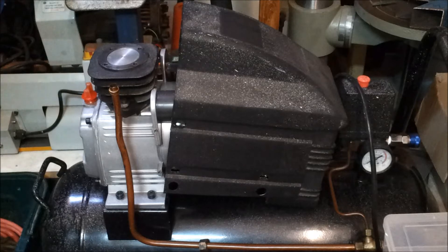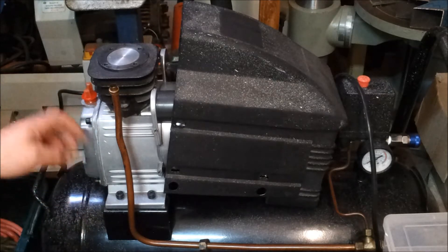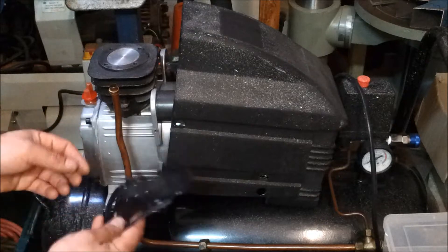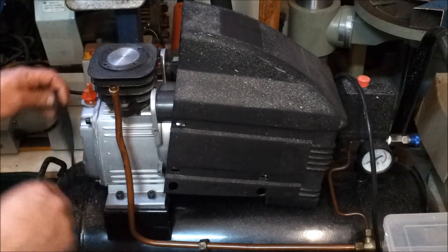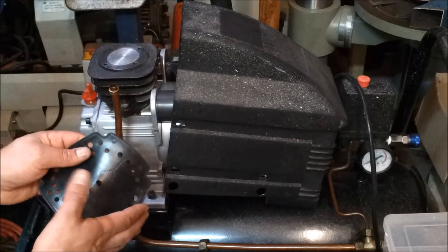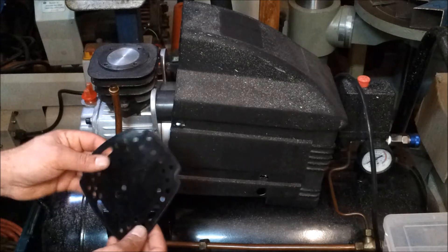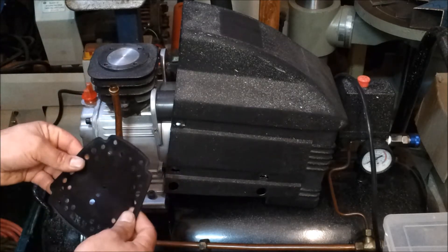When I took this compressor apart I cleaned it all out and got it ready to reassemble. When I got to the stage of putting this end cap back onto the main housing I realised that the gasket — which fits in between those two pieces — had shrunk down in all directions by about three or four millimetres. So I wasn't able to get it to fit in the grooves properly and couldn't use it.